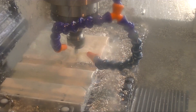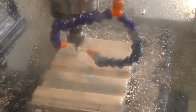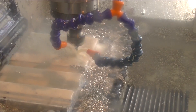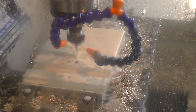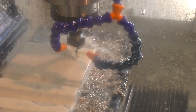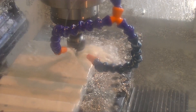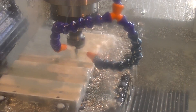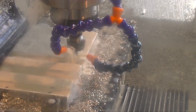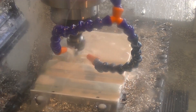All of this is being played back at four times speed, so it does look like it's moving a little fast — but it is definitely moving faster than real time. Not that it was moving slowly, but I had things dialed down a little bit so I could click and walk away from it. Now obviously there were some mistakes made, but we talked about that in the other video. So the last part here was just our contour ops — clean everything up, make sure that we're ready to go. I played it very conservative on this so I could just click the button and walk away. The only issues I really ran into were the chip compaction problems.